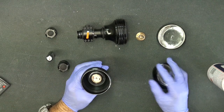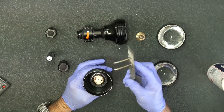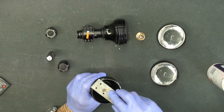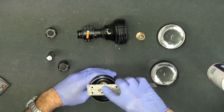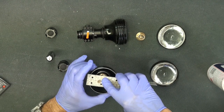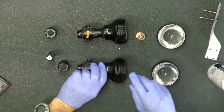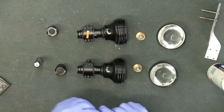There's the glass — the spherical lens. Now you've got the pill inside, which is screwed in. I've made a little device, just a piece of metal with a couple of screws sharpened to a point, and you insert it like that, hold it, and unscrew it. If you do it this way you can hold the pins in carefully and rotate the whole body of the torch rather than turning the tool itself. Keep going until it just about pops out, and there you go — that's the pill.